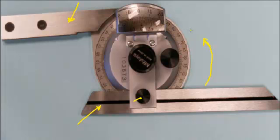We have two scales on this protractor. We have a main scale, and there are actually four quadrants of it at 90 degrees each. You can see 90 degrees, and then it goes right and left of that 90 degrees. Just underneath this magnifying glass here, which is used to help magnify the measurement because it can be a little tough to read, we actually have the vernier scale. This scale is divided into two quadrants of 12 divisions each, and it breaks a degree down into 12 parts, or five minutes of a degree. So the accuracy of this tool is five minutes of one degree.